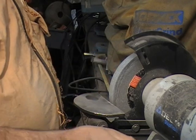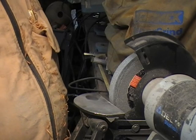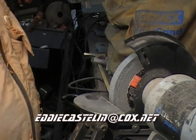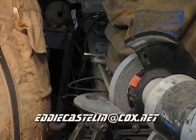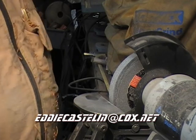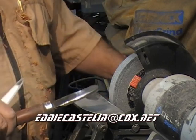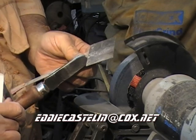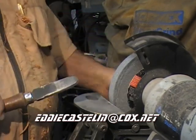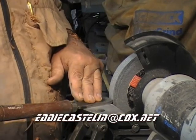I've changed my coarser wheel, got rid of that piece of it, and put a much better 80 grit Norton XXX. I don't do the color thing, red, blue, pink, whatever. Norton XXX. Now, I like my scraper at 15 degrees. You can check yours. If you're close, leave it alone. Take it over to your grinder and set your platform to that 15 degrees.